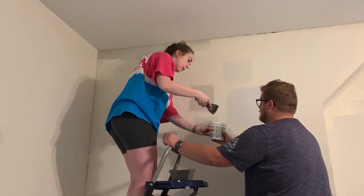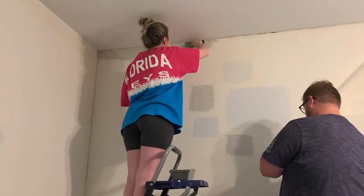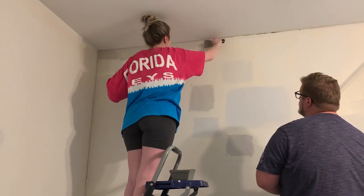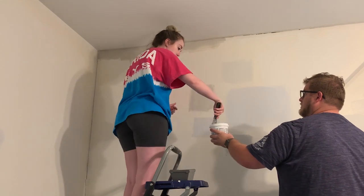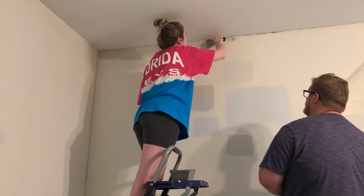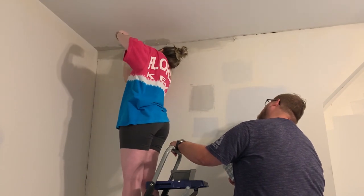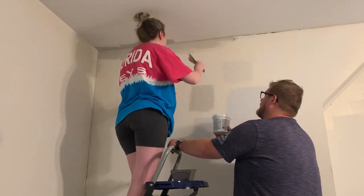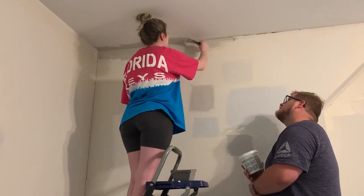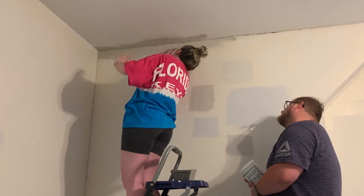The way you put drywall tape in is you put a thin layer of mud up first for the tape to stick. You can buy self-adhesive tape — I'd make sure you do all of your research on which method you want before you do it. We used the non-self-adhesive kind, so I put a very thin layer of mud down on the wall first, then put the tape down, and then at least two or three layers of mud on top. All in all, this was about a four to five day project just for the drywall taping. If you don't have that kind of time, hiring a drywaller might be the way to go. But we had the time, wanted to take on the challenge, and I cannot imagine how many hundreds of dollars I saved by doing this.